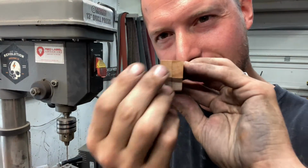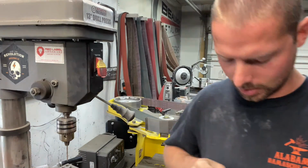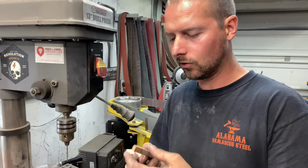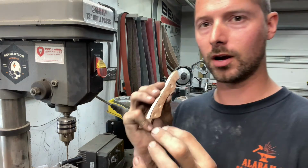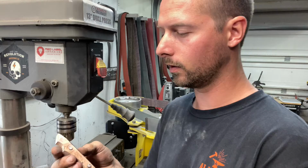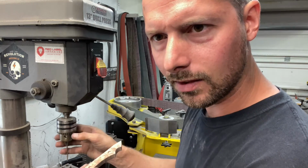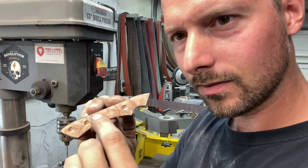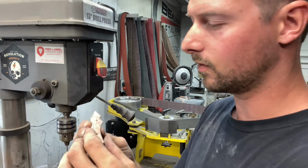All right, we got our fronts cleaned. It's looking really good and buffed. Now the next step is, see if I can get these apart. Making sure that when I glue these scales up, I'm 100% confident that they will never have a problem. And I think what I'm going to do is I'm over at the drill press here. I've got an 1/8 inch bit in right now, and I'm gonna drill as many little holes in the side that's going to the knife as possible.